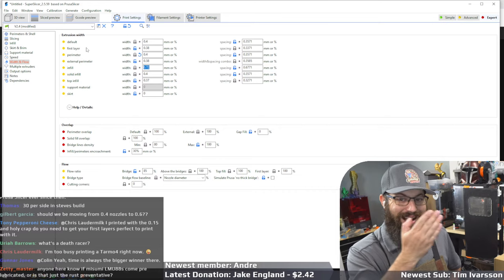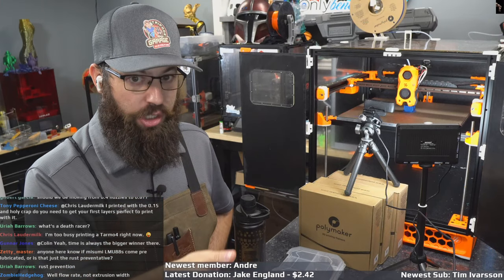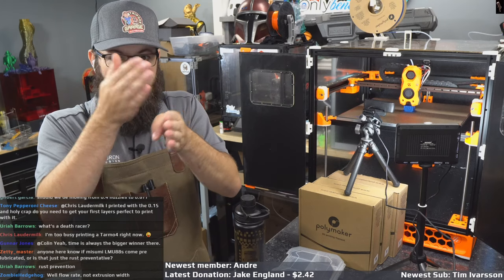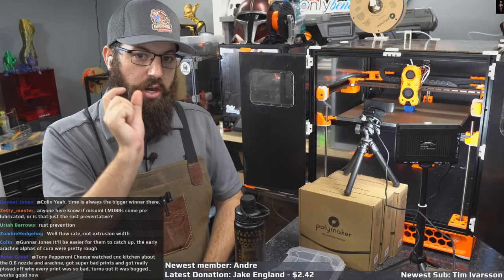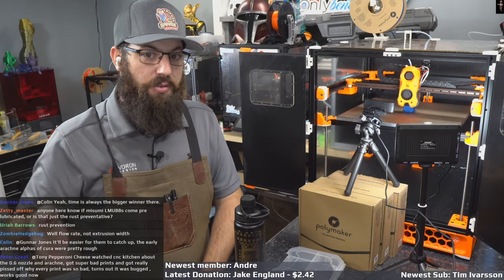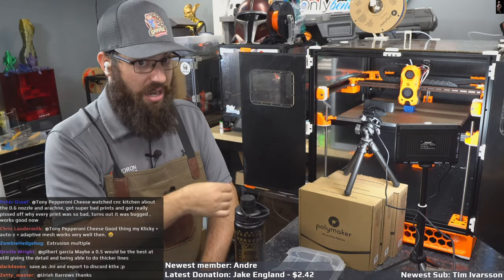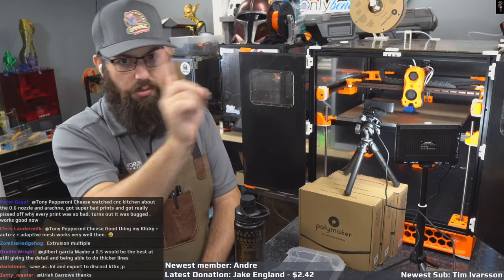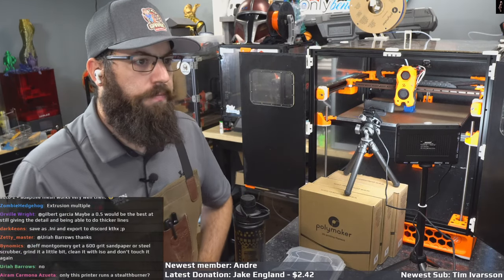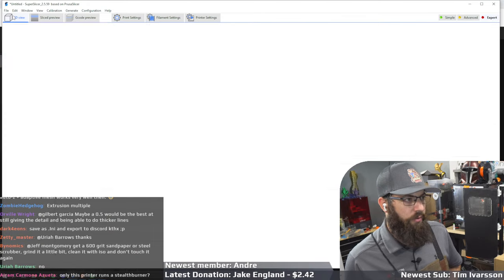That way you have to do less lines to get X percent infill. Because infill, you need to remember, is a percentage. So if you have 20% infill, that means over an XY distance, 20% of that infill will be material. So if you print with a larger extrusion width for infill, that means less lines for infill. So when you print high percentage infill, you get less lines, but each line is stronger and you save a lot of time. They're thicker lines that are stronger. Saves a lot of time. And then top fill I under extrude so I don't over extrude on the top.